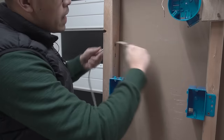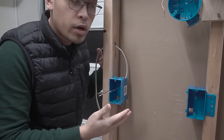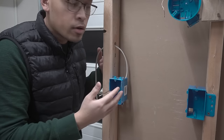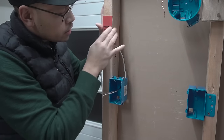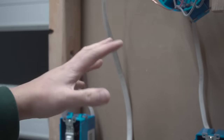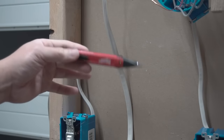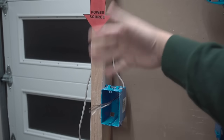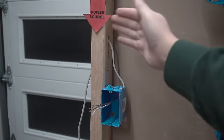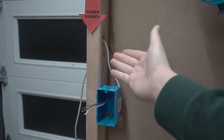The first thing we're going to do is feed the power source to our first J-box. This is a 14-2 wire and this power is either going to come from your circuit breaker or from another receptacle on the same gauge wire. I'm going to label this the power source. Before working with any type of electrical, make sure you turn off the power from your circuit breaker and always check with your voltage detector. Always test your voltage detector first on a live wire so you know it's working properly. When you turn off the power from the circuit breaker, there's no more voltage. You at least need six inches of exposed wire sticking out.